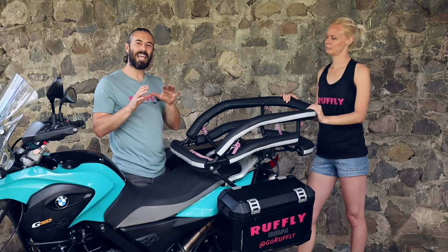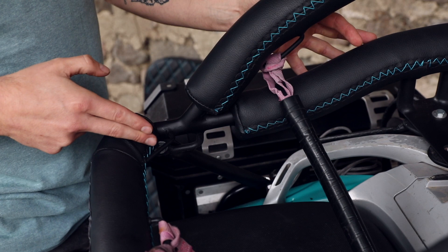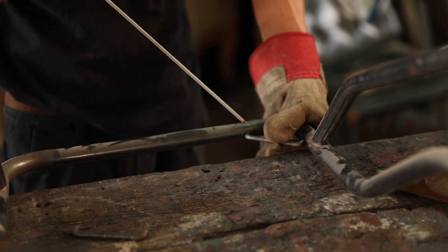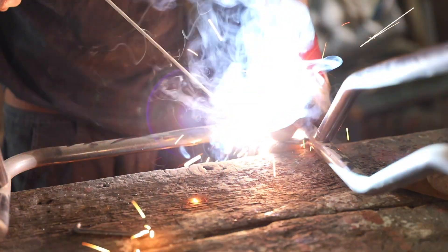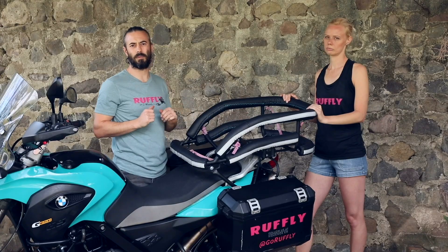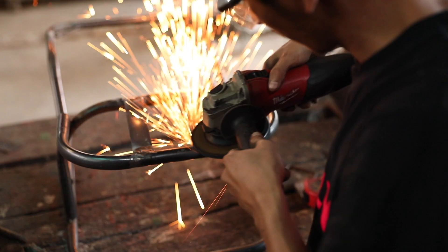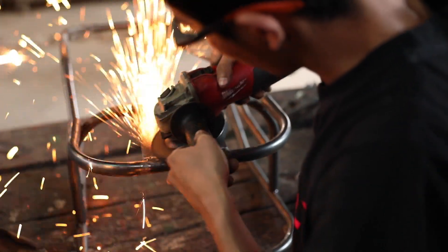The cockpit has nine anchor points: four in the rear corners, four in the front corners, and then the ninth in the front center. They're made of three-eighths inch bars that are welded to the frame. This is for tethering or harnessing your dog securely into the cockpit, as well as mounting gear to the exterior. Once the cockpit frame and base plate are finished, we polish all the weld points and then put on anti-corrosive paint.